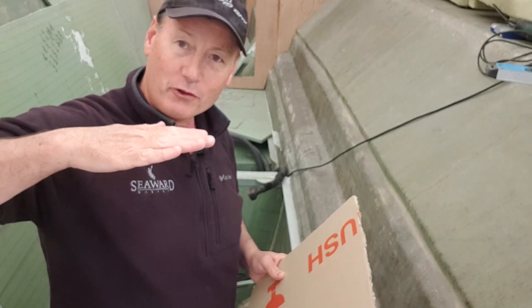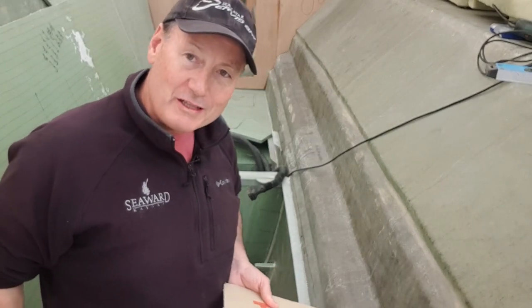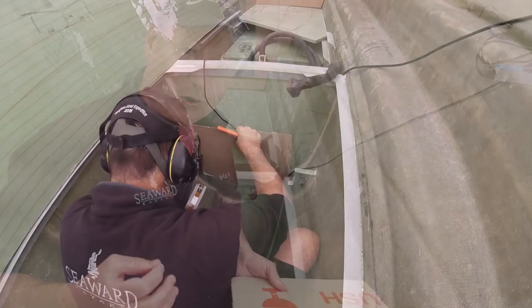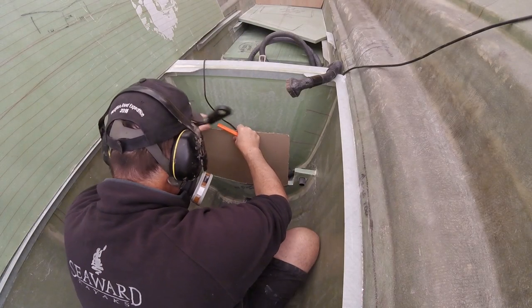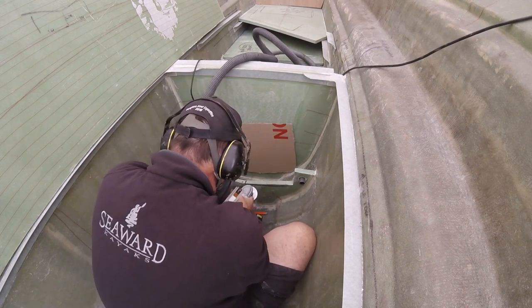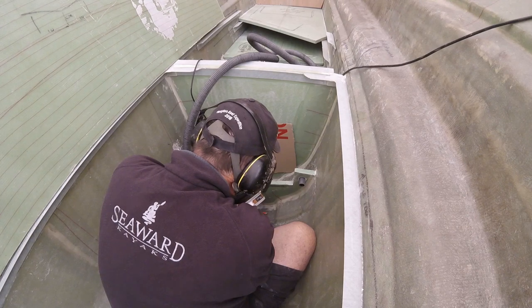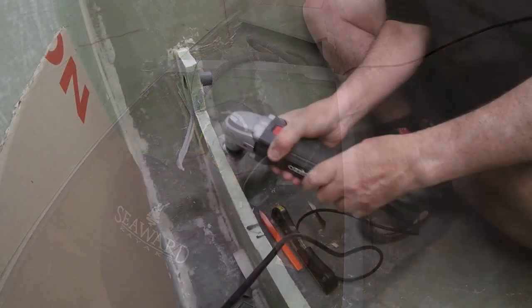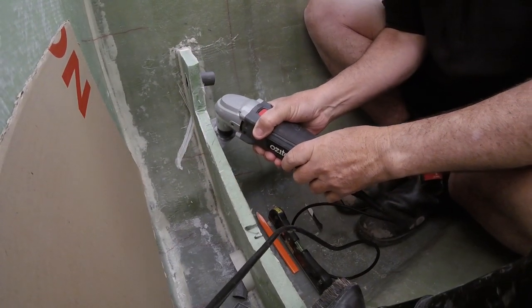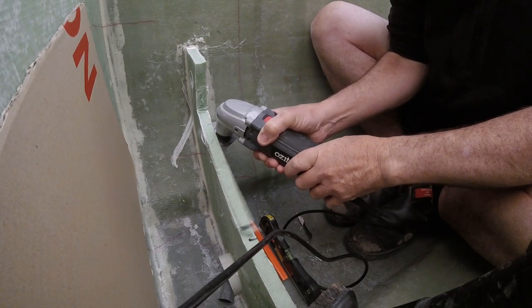I mean, I thought about sloping it slightly back towards the intake, but I'm trying to avoid having any of the detritus and everything being picked up in there, so I can still clean it out with a pump and a separate hose. The idea of this is that I can get an exact level all the way through, so that I can then put in my angle and reinforce the actual slat bed for the underneath of the fuel tanks.